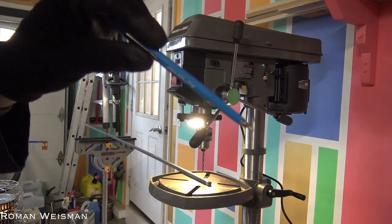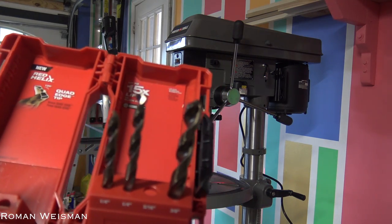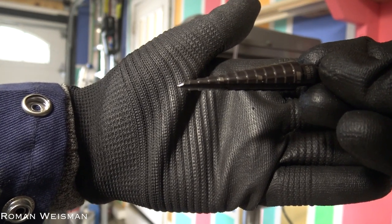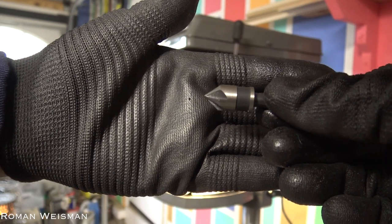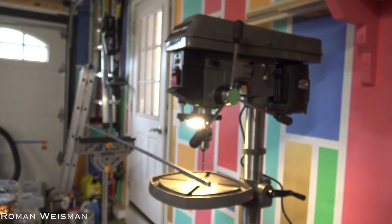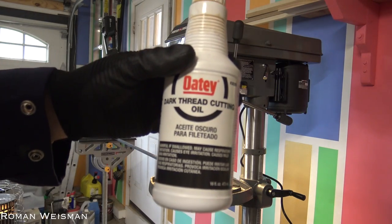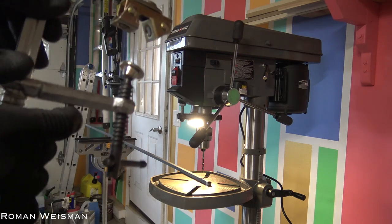I'm making marks on the steel with this pen. I use the Milwaukee quad edge drill bits but they are slow. I also tried this other drill bit — it didn't work well, at least for me. For countersinking, this tool is sometimes fine, sometimes not great. Before drilling I'm applying a drop of oil, and I'm holding it in place with those quick-release clamps.